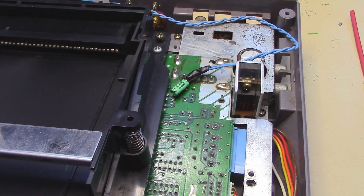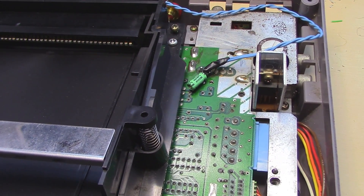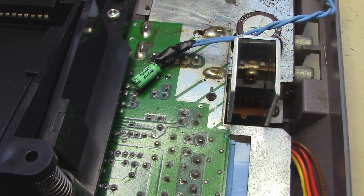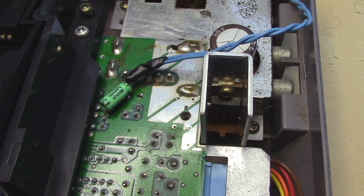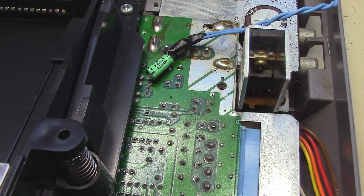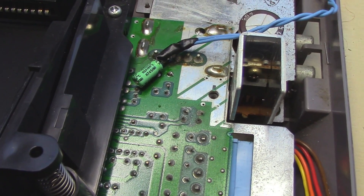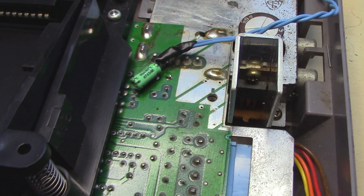So now I'm going to close this up and hook it up to the TV and see if the sound is okay. In my other videos I used 4.7uF capacitors, and I used the same type here. I've seen schematics that use one microfarad — you can use either 4.7 or one microfarad. I'm using 4.7, that's the stock capacitors I have around, so that's what I'm using.